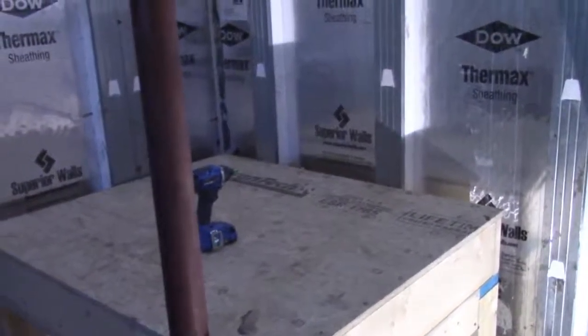I got a little bit of an overhang here, you can see. This is going to end up being 3/4 inch so that my riser for this first step will be able to be flush and still be the right size and all that. So I'll trim this back to 3/4 inch probably after I'm all done. But now I can actually start on the stringers for the stairs.